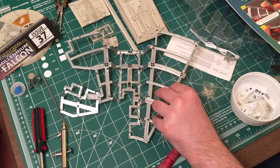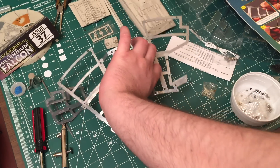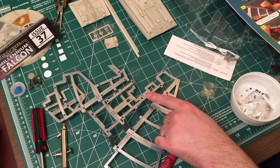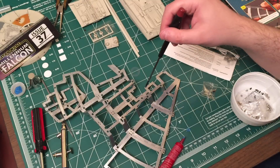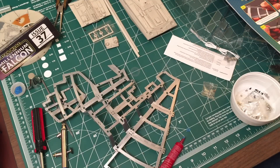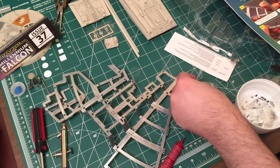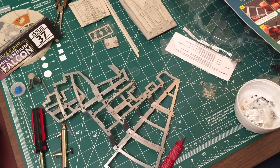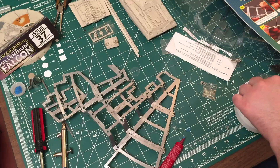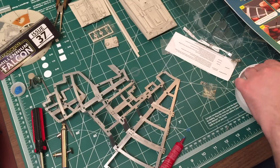So this is where we start putting in the connectors and it is kind of difficult to see. The orientation is kind of upward like this. Screw a two-hole connector across the corner joint between frame BF7 and BF5 - that's going to be this little joint right here. The reason we're doing that is because the motor is going to mount to the back side of that in a future episode. I've seen a lot of people mess this stuff up by not paying attention to the instructions and accidentally putting these two-hole connectors on the inside.